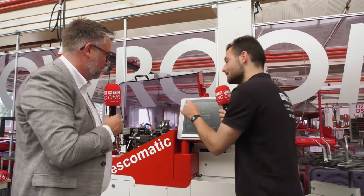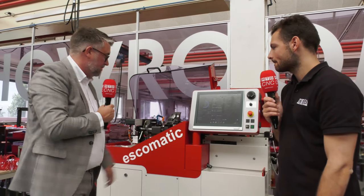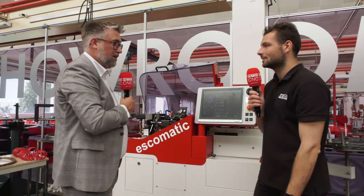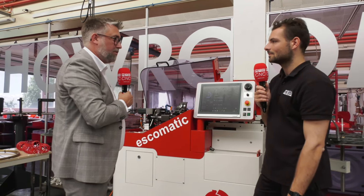What max diameter can you do on the D2? The D2 is from 0.3mm diameter up to 4mm. Two tools on this one, one counter collet — really simple, high volume parts: dowels, pins, knurled dowels, very specialised high volume parts. So even knurling you can do on a small machine like this? Exactly — knurling, cutting, turning, two tools, very efficient for big volumes.